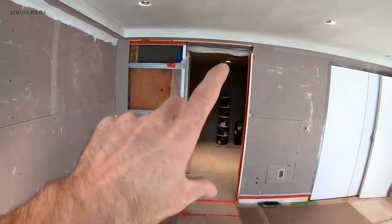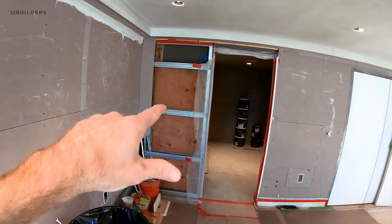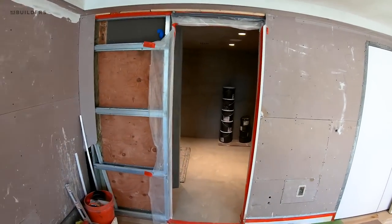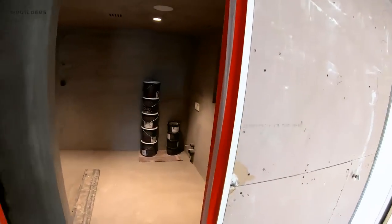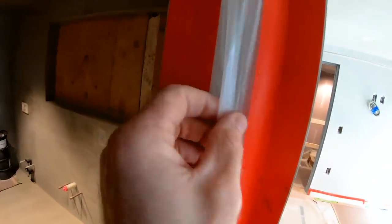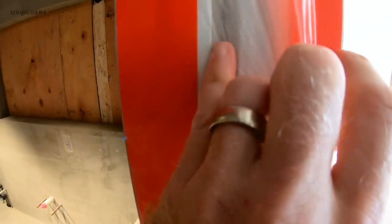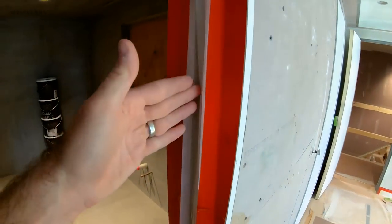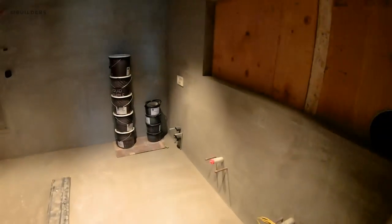This door, I think it's here, or it's gonna be here really soon. That's gonna be a glass panel, all frosted, pocket door. No trim around it. It's just a glass pocket door. It's gonna look really slick. And the guys did a really great job kind of seeing here, but there's a groove for that glass to go in, and there'll be a bubble seal back in that kerf cut. So when the door shuts, it hits that bubble seal with a nice tight seal.